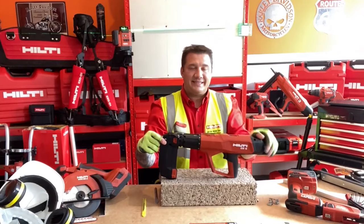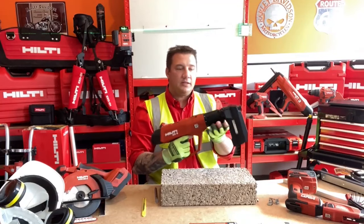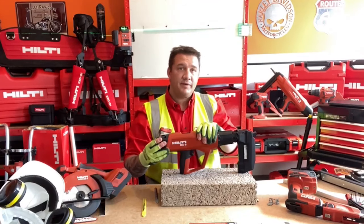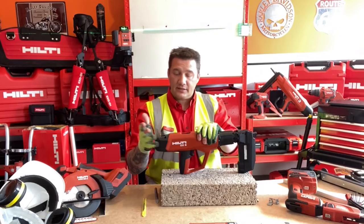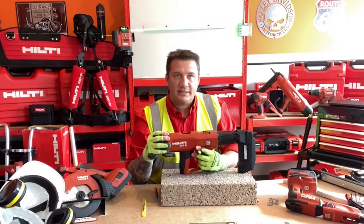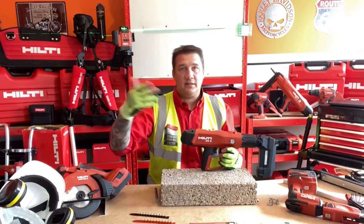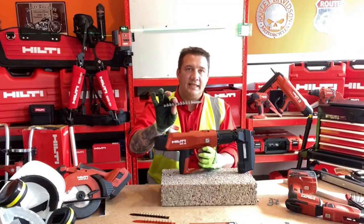As promised, let me show you the new DX6 direct fastening tool. This is new — it's going to eventually replace the DX5. It's got a good robust solid feel to it. There's a digital interface at the back to track maintenance and how many shots have been fired; it connects to our free Hilti Connect app, which shows you the maintenance history of the tool. The main difference is how you set the power settings. Traditionally we use different color cartridges — yellow as standard, red, up to black — depending on whether you're going into steel, concrete, or hard concrete. Well, that's made a lot simpler now: with the DX6 you use one cartridge — Titanium — for all power settings.